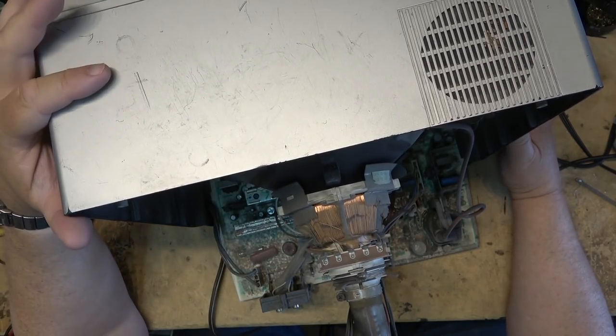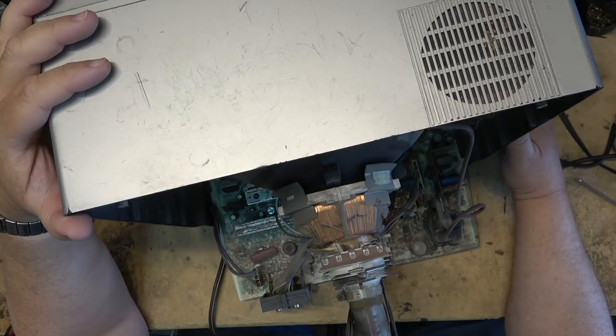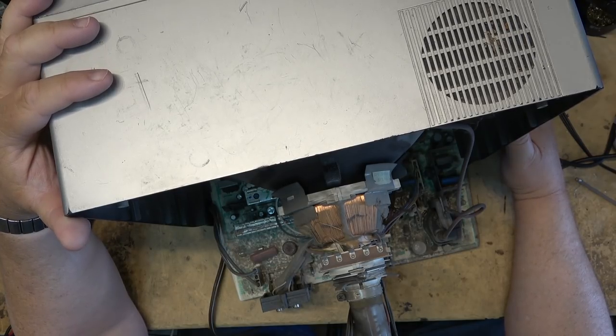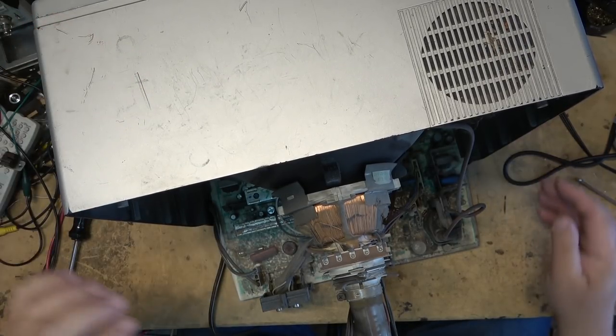I would get new TVs that we had to change a picture tube on brand new because the purity was bad. And we'd change a new tube and find that the new tube was just as bad because the carrier bounced it during the shipment. So they were great, but as I say, the tubes themselves were easy to damage.